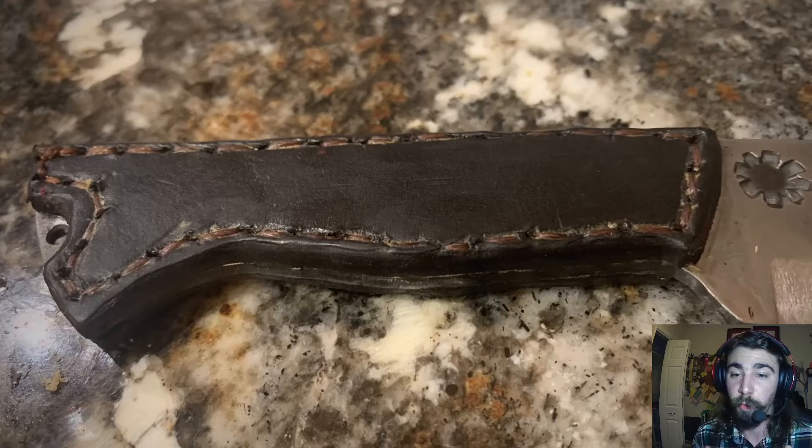After you've done the forging, you can sit down and work away at the handle — it's something unique that a lot of other people won't have, because lots of knife handle courses just use wood. This is different. It also gives some leeway for mistakes in the tang; if it's a little warped or sanded too much on one side, the nice thing about leather is it kind of swells and fills those gaps, making your piece look more finished even if you have mistakes. That's really good for beginners.